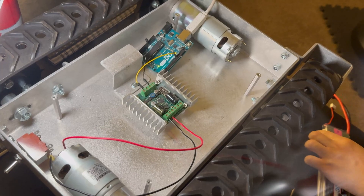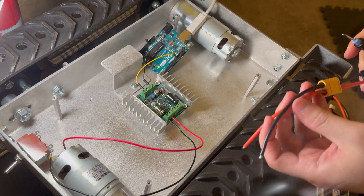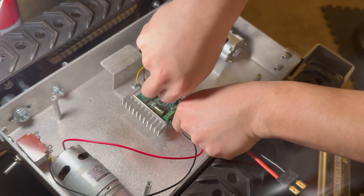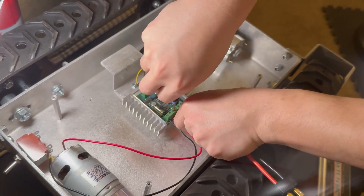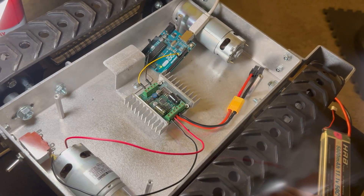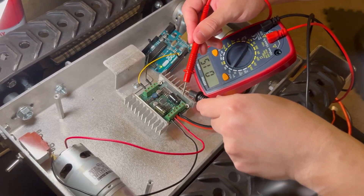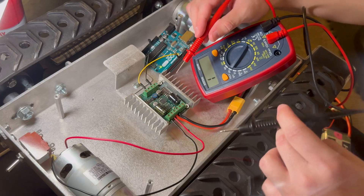Here I'm connecting my battery interface. I have a connector built previously for another project. I'll be testing with an 11.1-volt LiPo battery at 50C. Later I'll upgrade to a 22.2-volt battery in series to give the robot more power and speed. The battery connector is an XT90 connected to an XT60 interface, then straight into the motor controller. I'm double-checking to make sure I'm not shorting the battery — that's the number one thing you don't want to do.